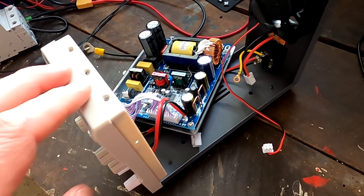So this was the initial test after shorting the capacitor. I asked them what the capacitor is actually for, and they said it's just an inline filter capacitor — it filters the power coming into the power supply. If you have a noisy network with voltage spikes it's better to have one. But I explained that this power supply runs off an off-grid system all the time, and they said don't worry about it, just keep the short across the contacts and it'll be fine. We don't need this capacitor, and I'm not switching to 110 volts anyway.